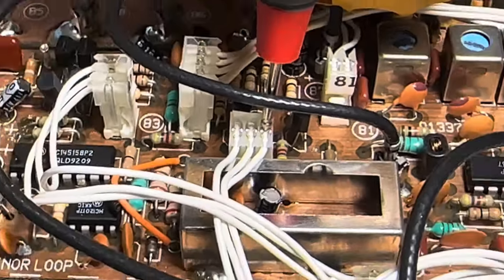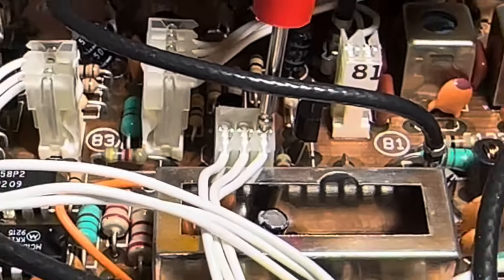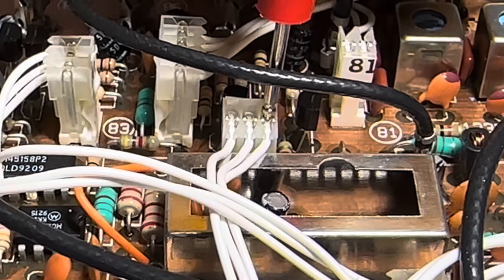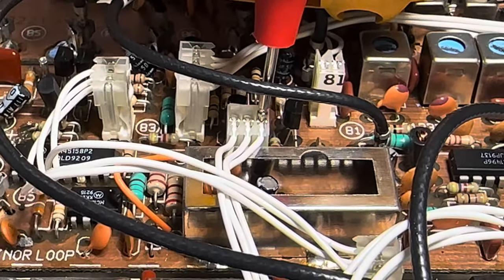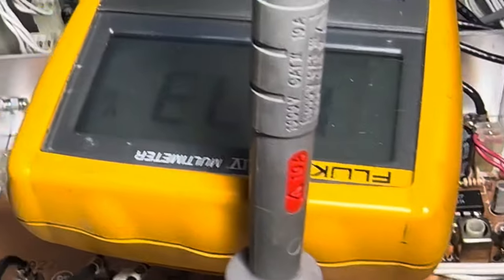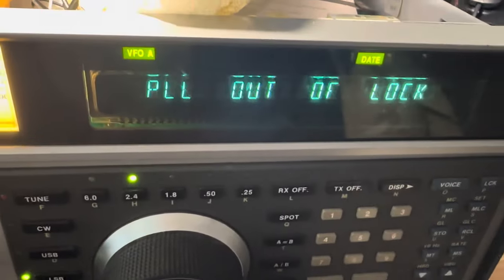Note these pins — one is 10.5 or something, one is 13.8, and that pin right there is the lock, phase-lock loop lock pulse pin. When it is not locked, it'll put out a number of pulses — probably the reference pulses. When the microprocessor counts too many pulses off that pin, it'll say 'I am out of lock.' I'm measuring that on AC now, and what you can see is roughly 1.3 volts AC coming off that pin, and I'm out of lock on 29.9.